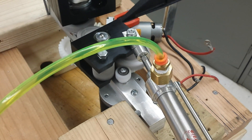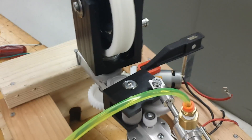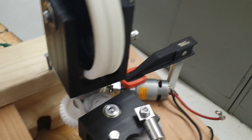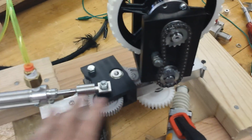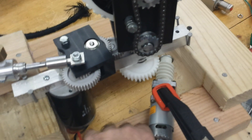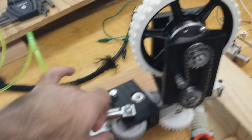I'm recharging the air because we run out pretty fast. One gear, another gear — no issues whatsoever. So as you can see, the system seems to work quite well. I didn't show you being loaded down because I'm out of hands — I can't record at the same time. But earlier we did load it down with a piece of wood, and we did get to 5 amps in high and low gear. The only limitation seems to be the power supply. Once we actually get the whole robot built and attach them, we'll test the whole system as a robot and see how it performs and whether we run into issues at any higher currents.